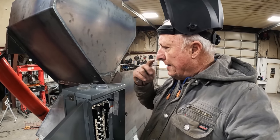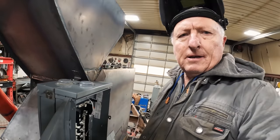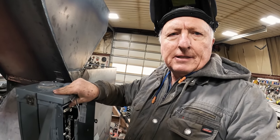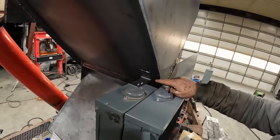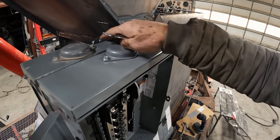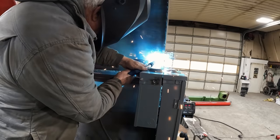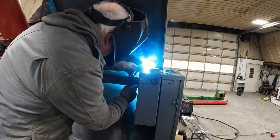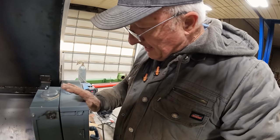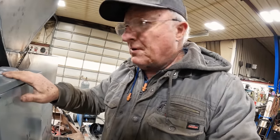Okay, got the box all together. As you can see there are three places where the box is connected to the cleaner, but this whole diagonal corner isn't really fastened. So I'm going to add a gusset right here — weld this part onto this — and then I have screws in case we ever want to take it off. Let me get the welder and we'll get this glued. Yep, that really strengthened it up — very little flexing now, so that'll work.